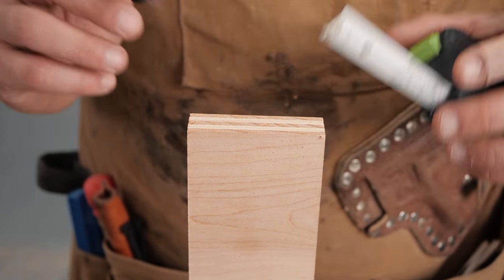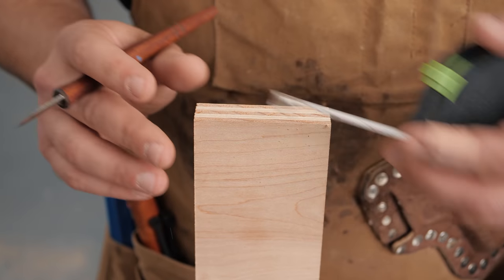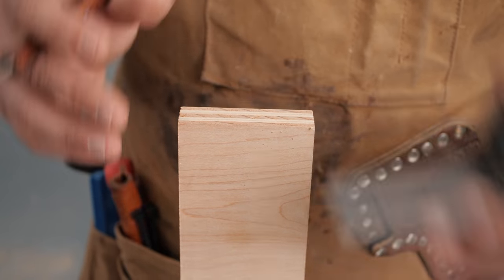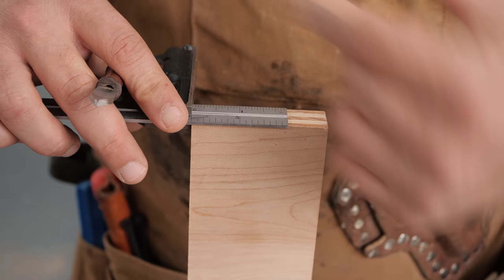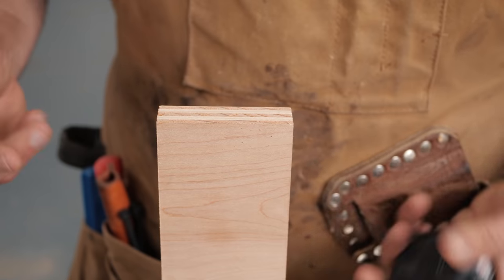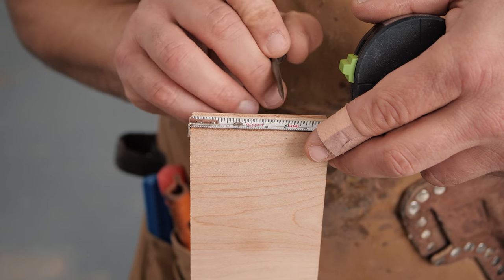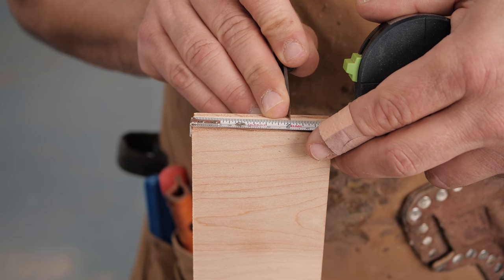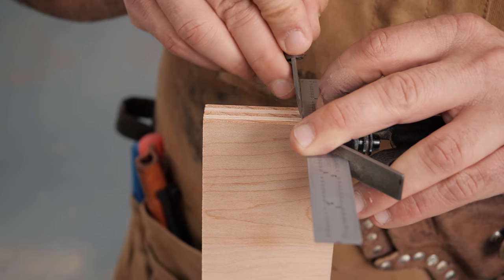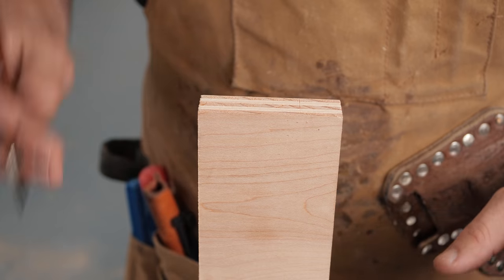Good joinery is done with a pencil; great joinery is done with a marking knife — that's one good thing to know if you're working in fine woodworking. Let's say I wanted to cut this to exactly two inches. You could easily use your square and mark it with your marking knife by placing it right next to it. A lot of people like to use tape measures, so we'll do it with a tape measure. You take your marking knife, put it right at the two-inch mark, hold it there, take your square, and you mark it. You only need to mark the face of the board closest to the table saw blade, and I'm going to show you why right now.